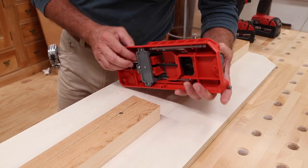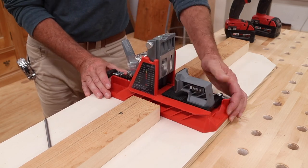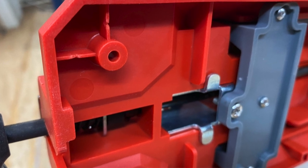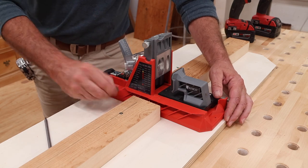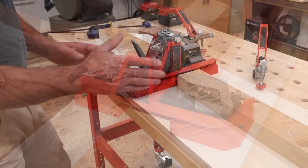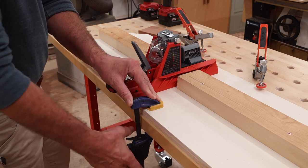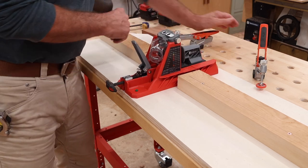If you're going to mount the jig like I am, you'll want to remove the driver beforehand. To mount the jig, I'm centering it in between the support arms, and I'll use 3 of the Armour Tool inch-long screws. You'll notice that the screw holes are reinforced, and that will prevent the plastic from bending or breaking when you drive the screws. With the jig attached to the board and the support wings in place, you could attach this to any workbench with one or two clamps. If you happen to have the Armour Tool workbench, you can use the clamp-down dogs.